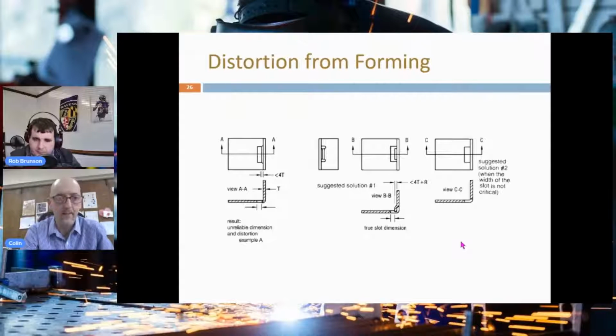Right. Using the same radius, if you're making a part that's got 4 different forms, and you're using 2 different radii on those forms, you're probably only going to end up with a more costly setup. If you do a consistent radius, meaning consistent tooling, the same tool for each hit, maybe you get a less costly setup, and it doesn't necessarily impact your design application.